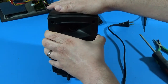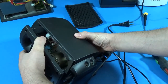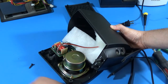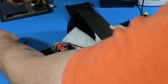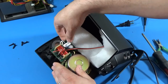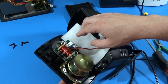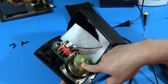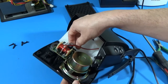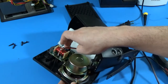There's a little bit of baffling in this speaker. That appears to be just a crossover — resistor, inductor, and capacitor. It just uses resonance to separate the frequencies out to the tweeter and the woofer at the appropriate ranges. I can test this capacitor — it's non-polarized — just to make sure it's good. But that doesn't really help me because what I want is down in here. I thought that's what I was getting into.